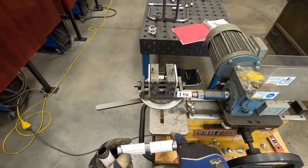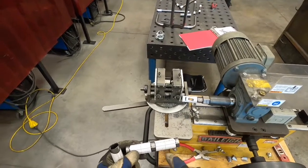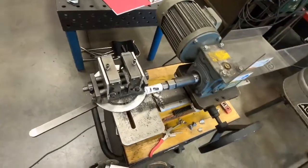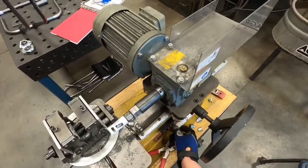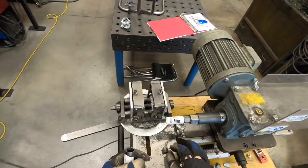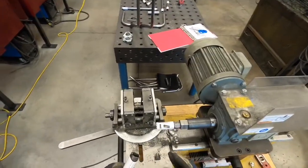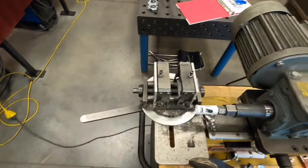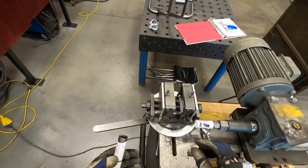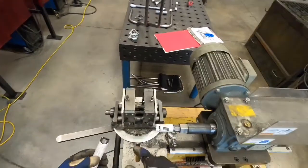The first one is just at one degree, and then the next one you'd have to rotate and do seven degrees, but only cut through half of it. Let's talk about safety with this machine — you see a lot of these little shark bite pieces come out. When operating this tool, these metal chips can be really, really hot. Open-toed shoes or even tennis shoes are a problem — I've had kids have these pieces melt through and stick to their skin, or burn exposed ankles. These are like little magnets for bare skin.